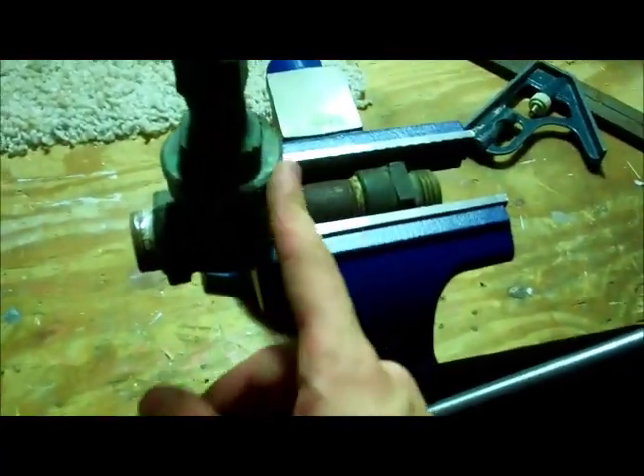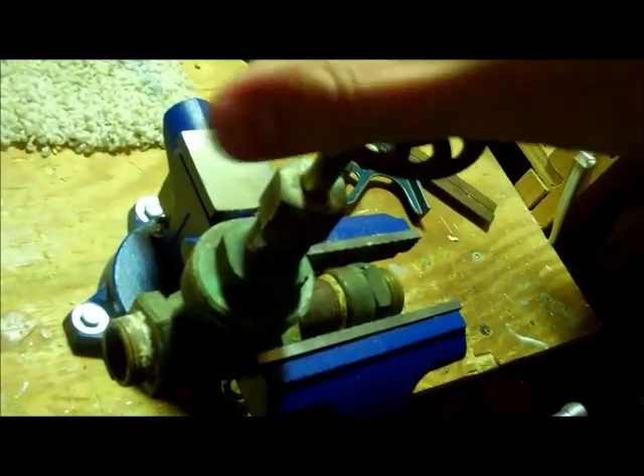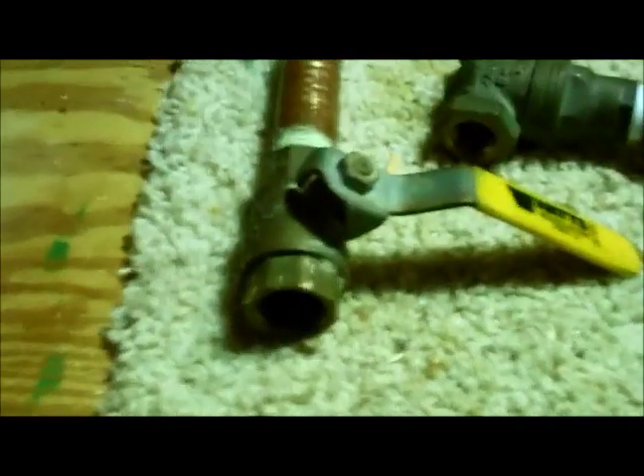I have an abundance of valves down here, and I want to show you another one — this is when you know you should just change the valve itself. When it's hard to open, and when you open it, it goes like this — just change that. It's not even worth repairing; just change the whole thing. If it's leaking and doing this, get a ball valve.